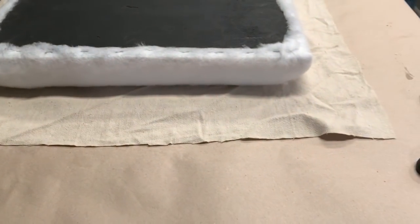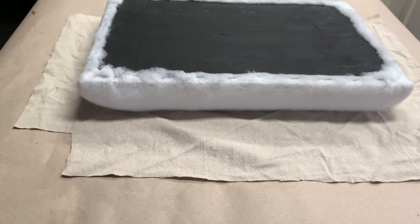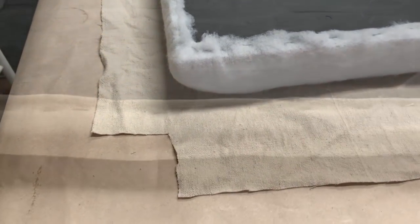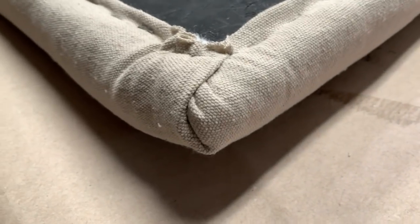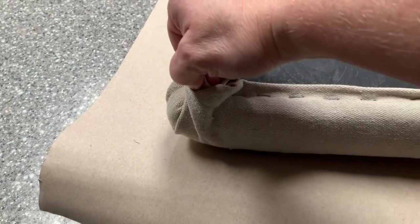And that's why I painted that bottom — same concept for the drop cloth linen. I cut out the square that I felt would cover, cut a little corner off, and make sure the corners are going to reach all the way over to the side so I don't have to worry about bunching and too much puckering. Then I fold that little edge over, pull it nice and tight, put my staple in, work on one side then the other, and try to make nice little packages — kind of tucking it up. Cutting that excess off really makes it nice, and I try to make my corners all uniform.